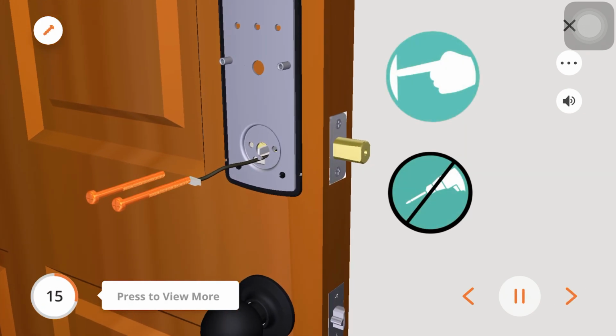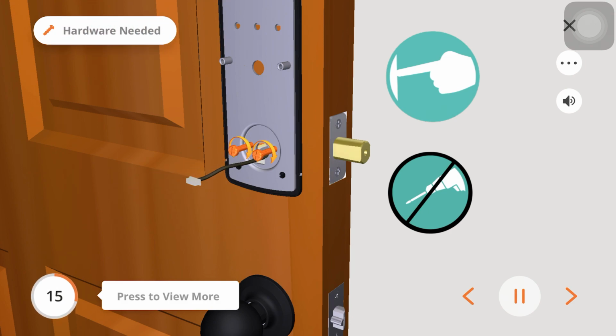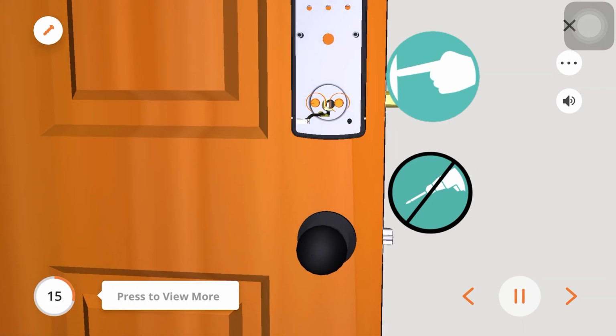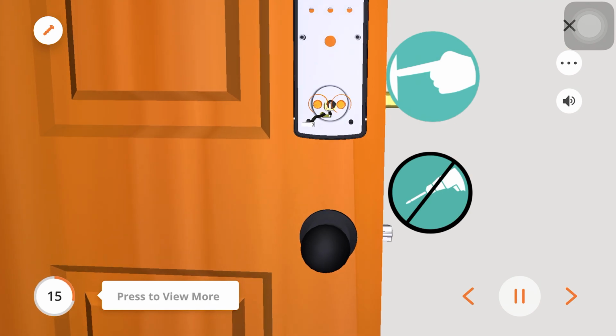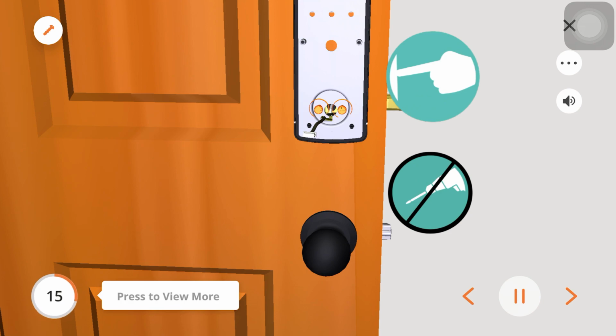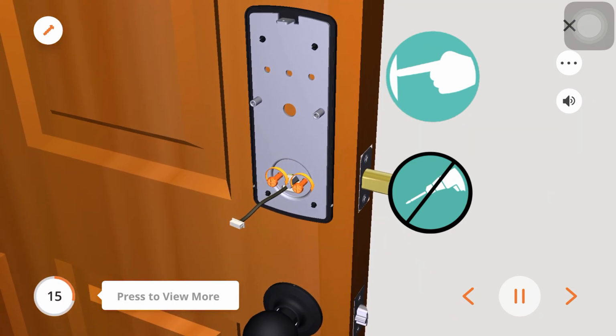Without using any tools, insert 2 screws, F, into the holes on either side of the torque blade. Carefully turn the screws by hand clockwise to catch the threads correctly. Turn the screws counterclockwise and make sure they are not cross-threaded and turn smoothly. Repeat if necessary and use caution. Once the screws have been inserted correctly, make 5 turns clockwise by hand.